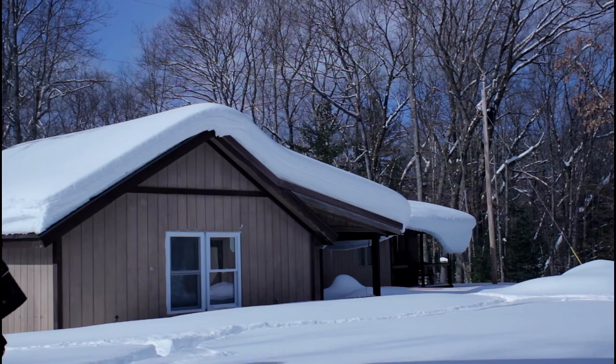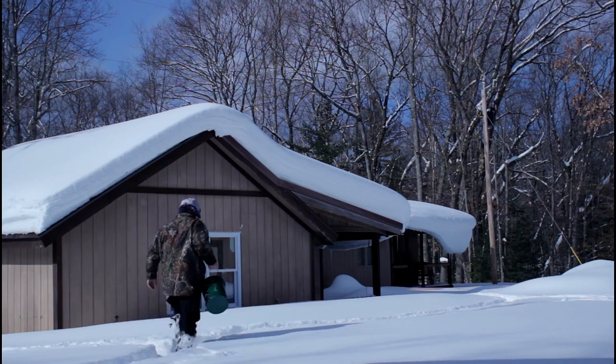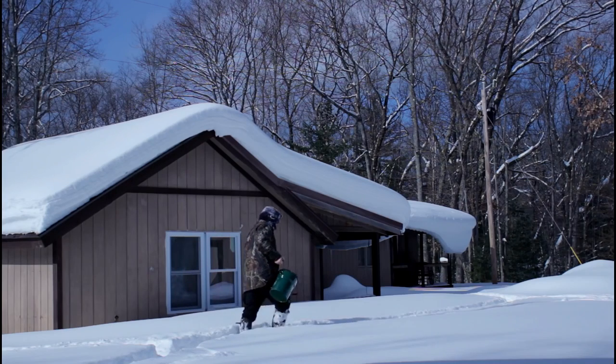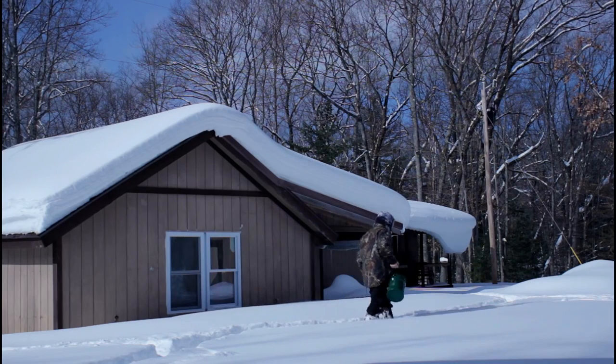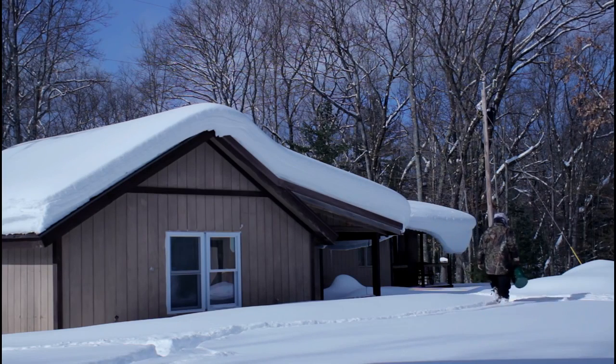For quite a few of us, we get snow in the winter, which causes 2 problems. First, you can't get to the panels to tilt them, and second, it kills power generation when they get covered. If you can't easily clean them off, you've effectively killed your winter power generation. Now, I'm not saying that you shouldn't mount your solar panels on the roof. What I am saying is to consider these challenges if it's the only place that you have to mount them.